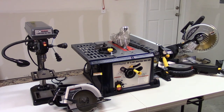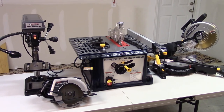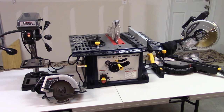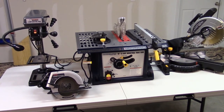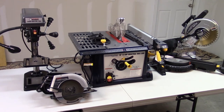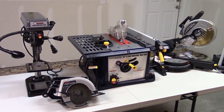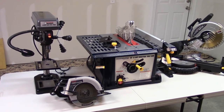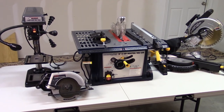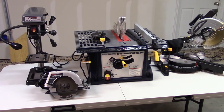Inspect what you expect. Always inspect your new power tools as soon as you get them home. Look for signs of damage on the shipping box itself — a damaged shipping box is an indicator that it was mishandled during shipping, which might lead to poor alignment of certain parts and even damage to the tool itself. Look for signs of moisture or humidity getting to the tool during shipping. The drill press in this video had some rust on it in several places, even though it was well-packed and coated with some form of lubrication when I first opened the box. Moisture can affect control mechanisms, electrical components, as well as the motors themselves. And always check the alignments on your power tools right out of the box — don't assume they will be set correctly from the factory. If you've seen many of my power tool reviews, you've seen more than one that was not quite in alignment directly from the factory.